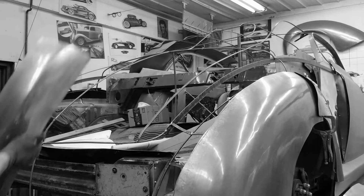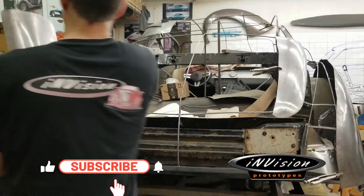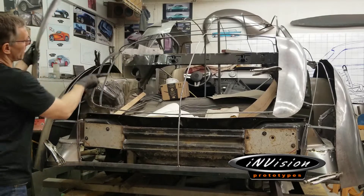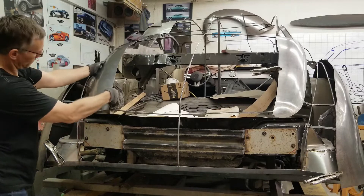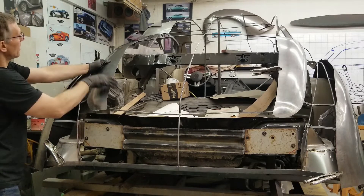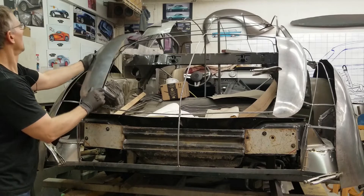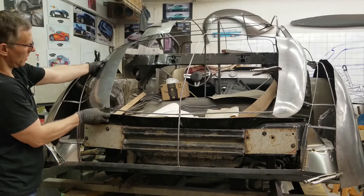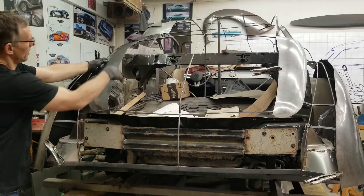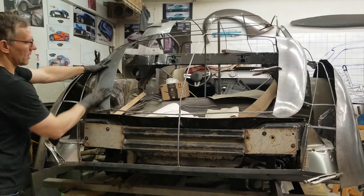Down here I just don't have the power in the fingers today to roll that around. Here's the driver's side tweaked a little bit, and going by this rod here it's sitting just about right — a little bit of space there, only because the end is down a bit. Bring that up a little bit. The anvil needs to radius out a bit; she sits right there. Going to get another clamp, squeeze that on, and then we start rolling out the center section — that's come out really really nice.